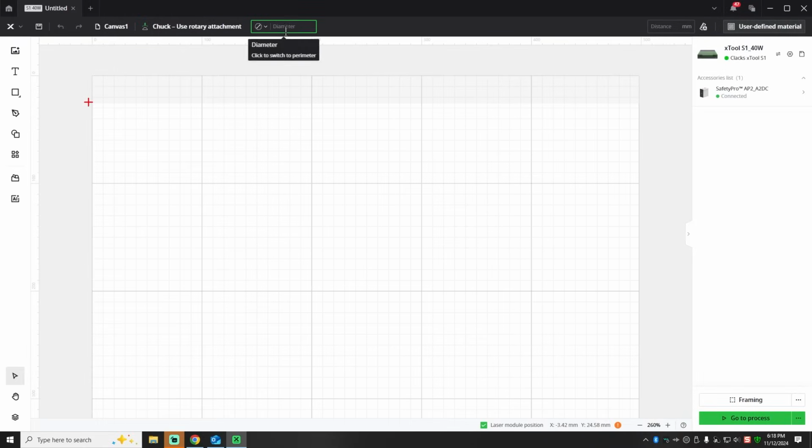We will need to get the diameter of the glasses, which we'll pick up while we're over there. And let me go set the machine to where it needs to be, and I'll take my calipers with me and grab the measurements right quick too. All right, we're gonna go with 94.5. They do have a bit of a taper to them. Hopefully that won't be a big issue. I don't think it's that big of a contour.